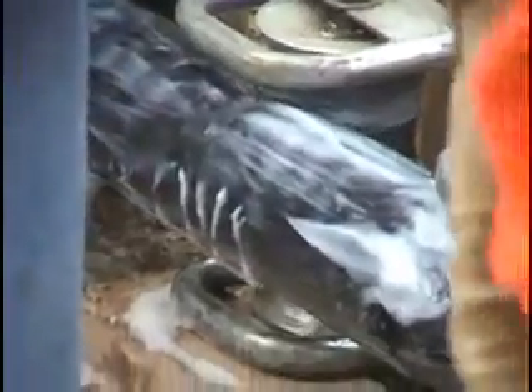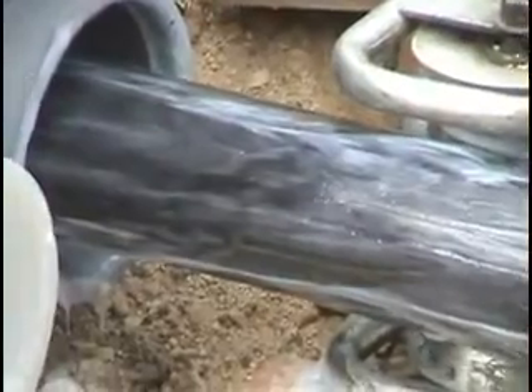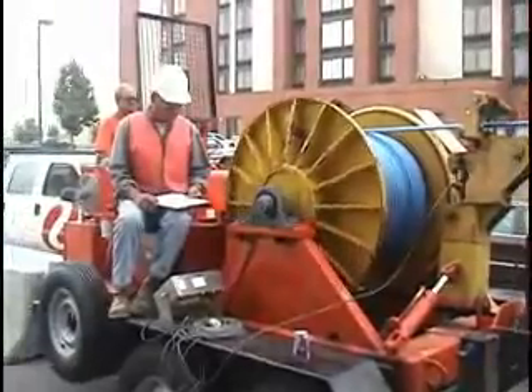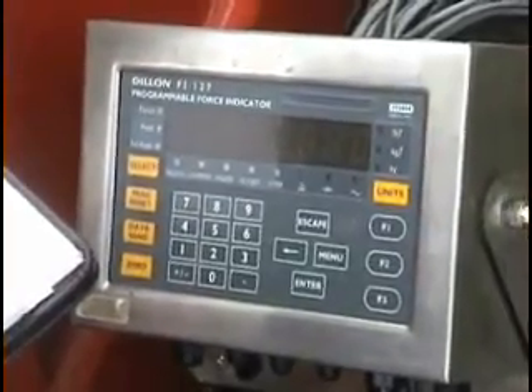Notice the amount of lubricant coating on this transmission cable coming out of the end of the duct bank. Polywater J's patented formula ensures that the lubricant hangs under the cable without rubbing off. The dynamometer readings on this cable pulling machine illustrate the importance of good pulling practices by keeping ending tension under the cable manufacturer's recommendations.